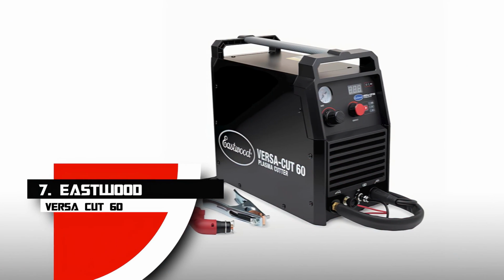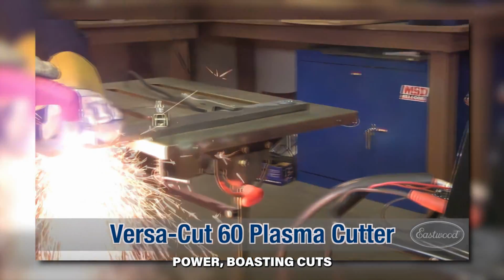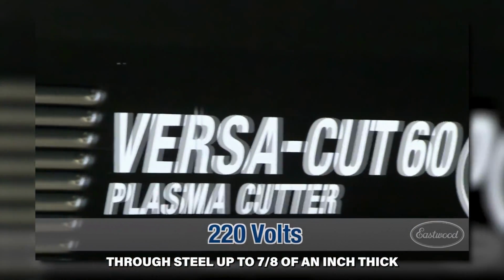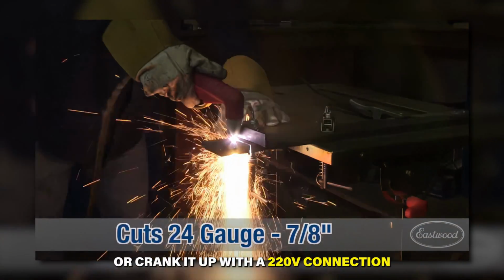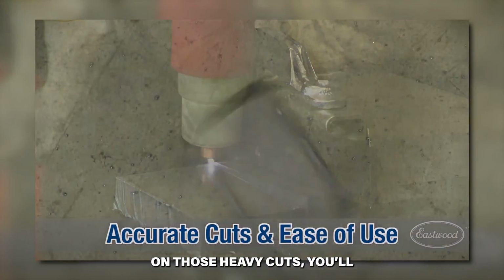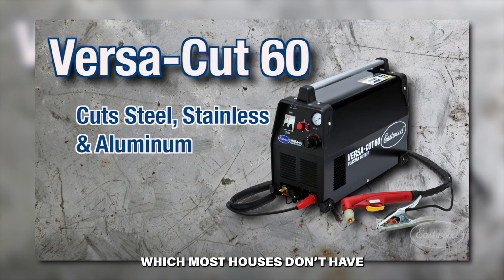Number 7. Eastwood Versa Cut 60. This beast has serious power, boasting cuts through steel up to 7/8 of an inch thick. It's also dual voltage, so you can run it on your regular household outlet or crank it up with a 220 volt connection. There's a catch though. To really push this machine on those heavy cuts, you'll need a beefy 50 amp breaker, which most houses don't have.